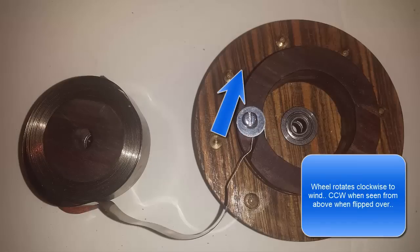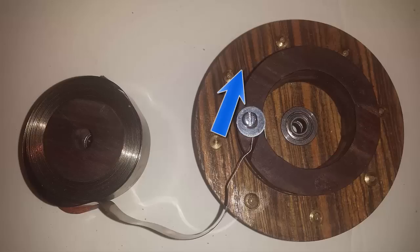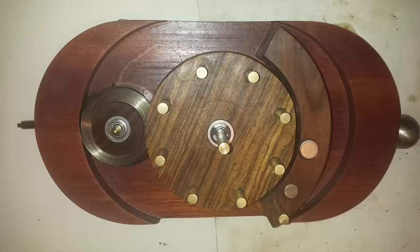When it begins to roll up the spring, winding the mechanism will wind the spring up in the direction of the arrow. This forces the spring to be reverse-rolled onto the take-up spool, and the pressure will cause the original roll to spin up and retake the material as the take-up spool wants to unwind from the reverse pressure of the spring. As specified, it's about a four pound torque at all times on the take-up spool once you've wound one or two winds. We then flip over the source and take-up spool and slide them onto the pins. The source spool just gets slid onto a brass pin which is hammered into the wood — it doesn't need anything to hold it; just being underneath the source disc will hold it in place.